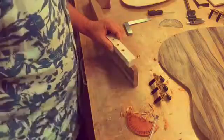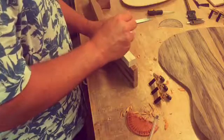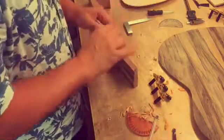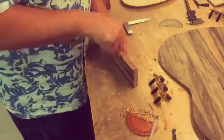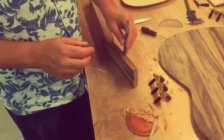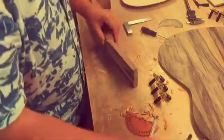And I'm not a great believer in measuring if I can get away without measuring, so quite simply, take a brad point drill bit, just dunk it down, give it a little bit of a push. I'm not pushing too hard, I've already done this, truth be told. And that will mark you the 3 holes. Then take your trusty bradawl and give a little bit more definition to those holes, so when the brad point drill comes in later on, it's got something nice to rest into, to take reference from.